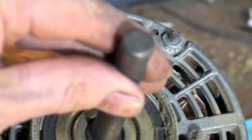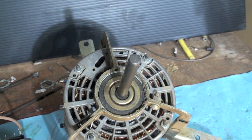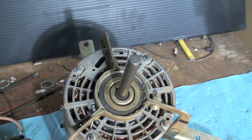It powers on but hasn't started — okay, there it goes. It's going counterclockwise. If I flip the blower wheel on one of these backwards it'll start backwards regardless of whether you've got a cap on it or not. So far: we had a fair amount of starting torque with the capacitor on, and almost no starting torque without it. We had to flip it most of the time to get it to work. A dead cap would give you amp draw but no rotation.